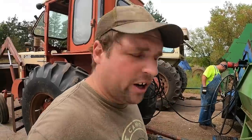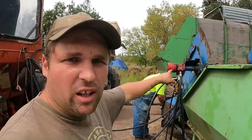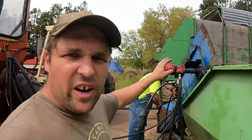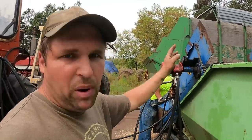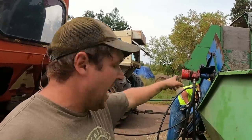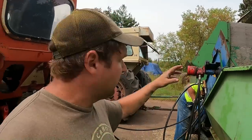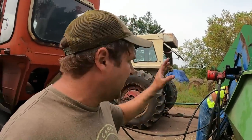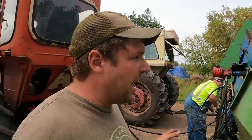Here we put a part load in of the bag. We got another full load here. We had a little bit of trouble. The conveyor that feeds the bagger is hydraulically driven, and we fired it up, and the seal on the end of that motor started just pumping oil out like crazy. So I had another motor on the shelf in the garage, same brand, same part number in the casting, same shaft size, everything. Bolted it right up, hooked it up.